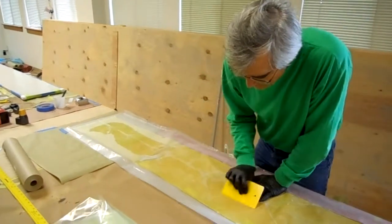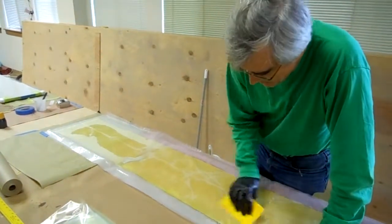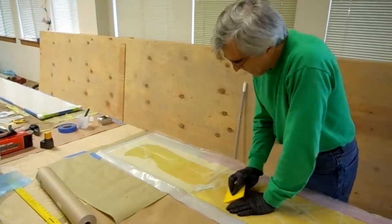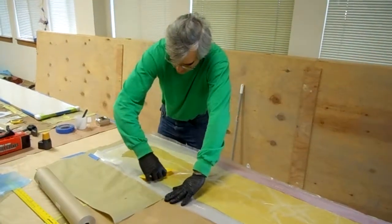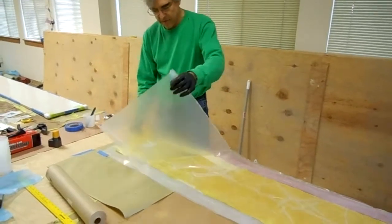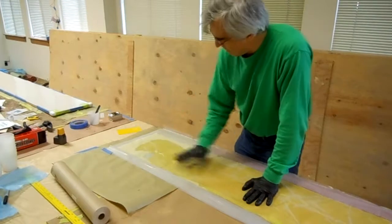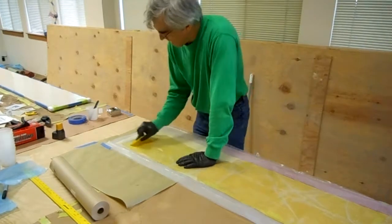After finishing, this will be the bottom of the trailing edges. This part will be put over on the very smooth piece of mylar over there in the vacuum bag set. Then the Rohacell trailing edge cores will be laid on top of that. Another one of these will be prepared slightly wider — 11 and three quarter inches wide. Then the whole thing will have a bleeder put on top, peel ply, bleeder, and vacuum bag the whole shoot match.